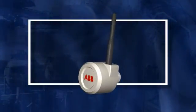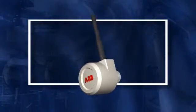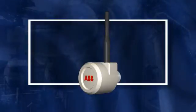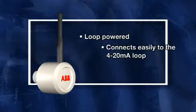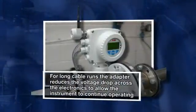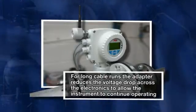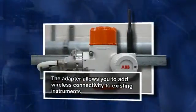The robust fixed antenna can be rotated along with the entire housing through almost 360 degrees so as to get the best position for the antenna. The adapter is loop-powered so that it can be easily connected to the 4 to 20 milliamp loop. There is no battery to maintain. For long cable runs, the adapter is intelligent enough to reduce the voltage drop across the electronics, which means the instrument can carry on operating even though it is at the end of a long cable run.